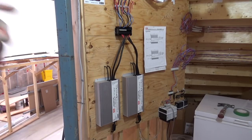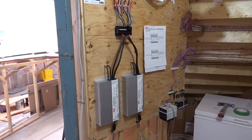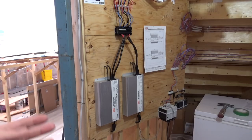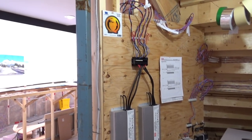These dim based on current and the LED manufacturer's dimmers work on voltage. What happened was these LEDs are common anode, which I didn't know - they don't tell you in the specification sheet. What that means is you cannot dim them the way I was planning on doing it. So right now we don't have the color dimming. I just have them hooked up in two banks - if I'm working on one satellite I power that one up, and if I'm on the inside layout, one driver is doing one side and one's doing the other. My brother thinks we can figure it out and add a few things to get that dimming working.